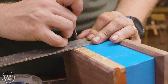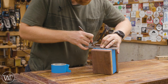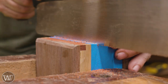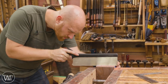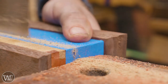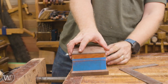Now we need to actually cut this box. We put a lid and a bottom on it, glued it in, and we need to cut it in half so that there will be a top and a bottom to it. Putting a little bit of tape on there helps protect it so there's less tear out. As long as you are clean and accurate with your saw you'll get a really nice clean cut. I chose a carcass saw which is actually a cross-cut saw — it feels weird running along the grain, so you see I'm actually ripping with this cross cut. The nice thing about ripping with a cross cut is it leaves a cleaner cut. The saw will actually burnish the edges because the teeth are more like knives than like chisels, so you get a nice smooth cut whereas a rip may actually leave burrs. And it was so clean that I didn't have to plane it — it just fit.